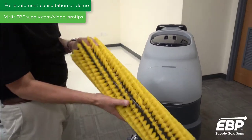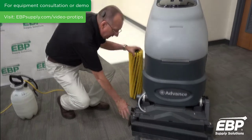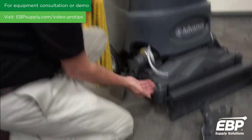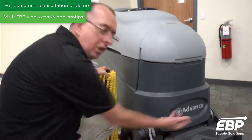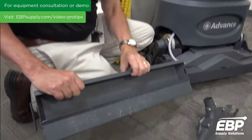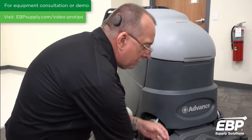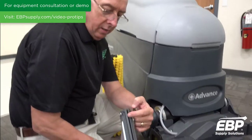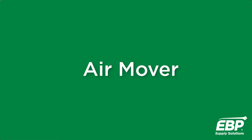Make sure you take the brush off and clean it thoroughly. It's also very important that the area where the brush goes is clean of debris — if it fills up, the brush will be making a lot of noise hitting dirt and junk. Keep it as clean as possible. This machine also has a debris tray that catches sand, grit, and big chunks — take it out and rinse it every day. There are also two vac shoes, one going to each back motor; keep those clear of debris as well.